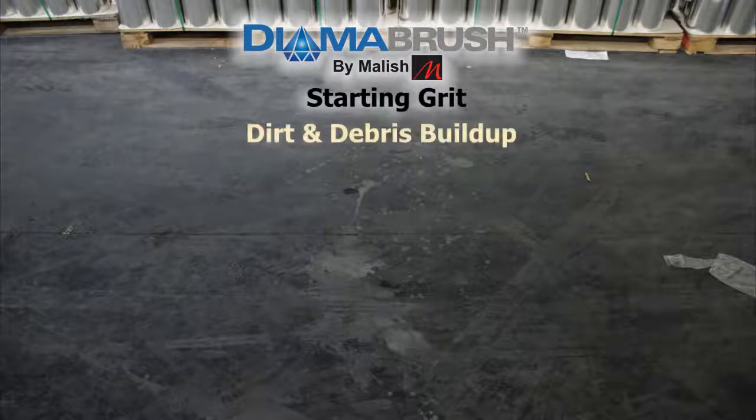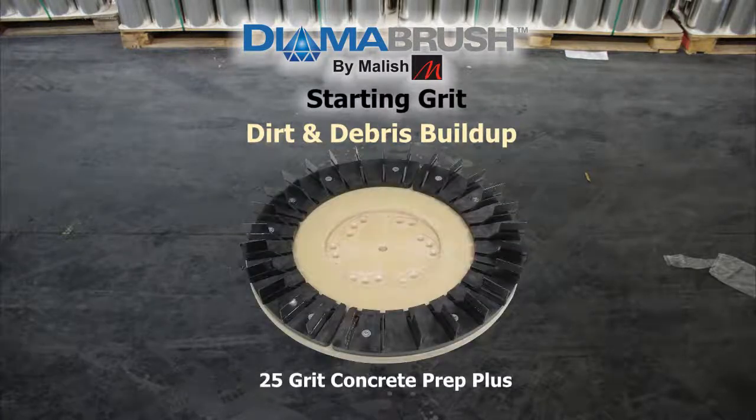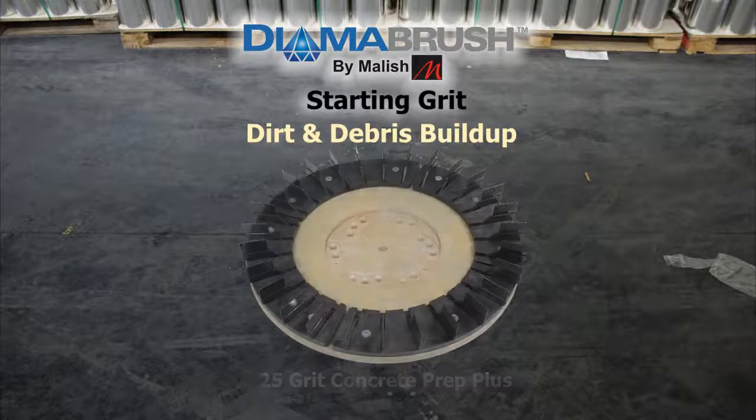If your floor has heavy buildup of dirt and debris, is pitted or spalled concrete, you must begin with either the 25 grit metal concrete prep or 25 grit metal concrete prep plus tools to level and even out the floor. You would then use, in order, the following tools.